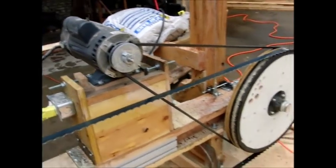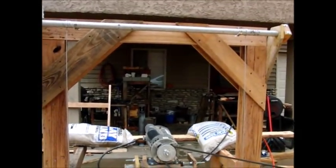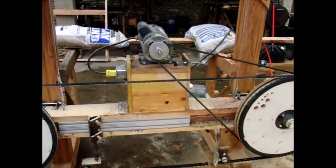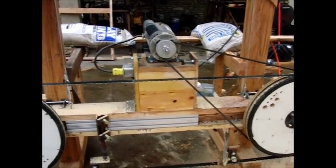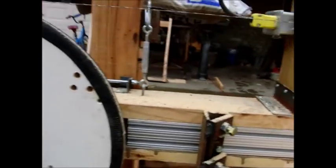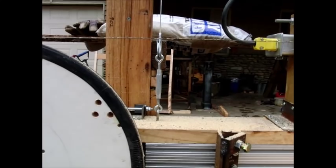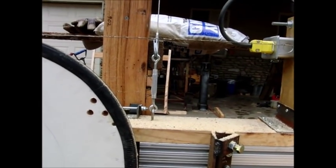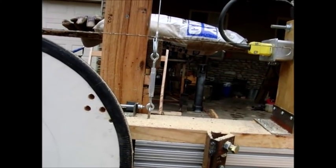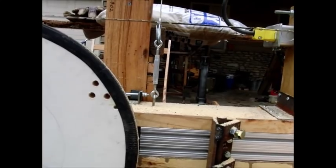I like the lifting with the two cables — that lets me be sure that both sides are coming up the same without any uncertainty. I also like this adjustment with the turnbuckle. Once I got it on the track and decided one side was a quarter inch higher than the other, I can just adjust that really easily without loosening everything up. That has worked really, really well.